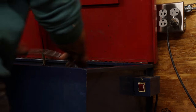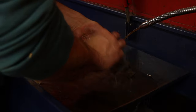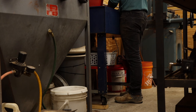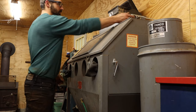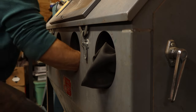First is the parts washer, which does exactly what it sounds like. You fill it with petroleum solvent and you can go to town on your greasy, rusty parts with Scotch-Brite pads and wire brushes. This one came with a handy pump that pushes solvent into a wand and lets you douse your part, your hands, and yourself in a continuous stream of cleaner. Next is a super useful thing called a blast cabinet — no, it doesn't have anything to do with explosions, but it's definitely the bomb. It's a sealed and ventilated booth used for sandblasting parts, using compressed air to hurl glass beads at the part you want to clean. It's extremely effective at removing rust and paint without doing any harm to the metal surface underneath, and in my shop this will be used a lot — though I may have to fight my wife for booth time.